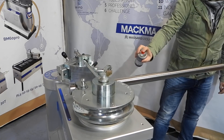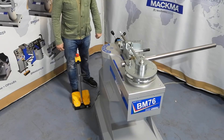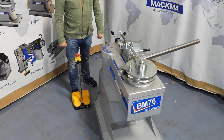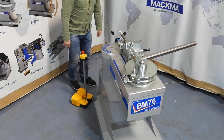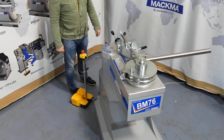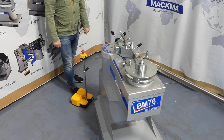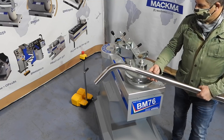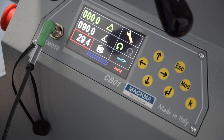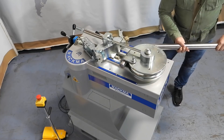But let's take a few more examples. This time let's take a different pipe — a pipe in stainless steel, with the same machine. Let's put it inside the machine, enter the bending angle, and make the first 90 degree bend. Then we measure the angle with a measuring device, calculate the difference, and that's it. Now I make the curve again with the spring back data entered, and the bend will come out perfect.